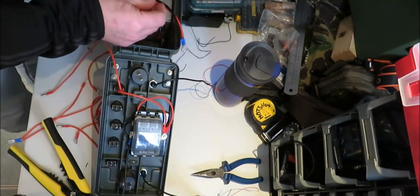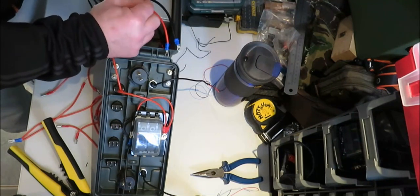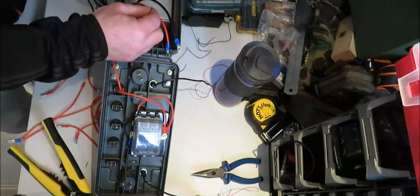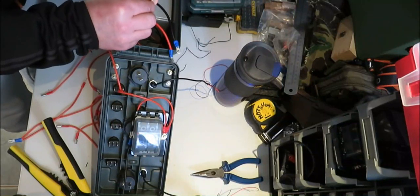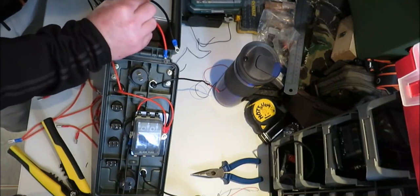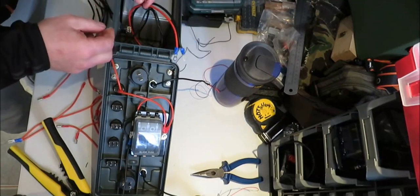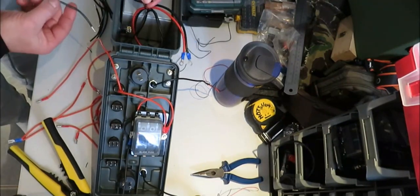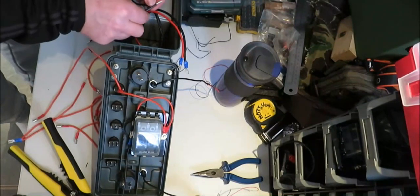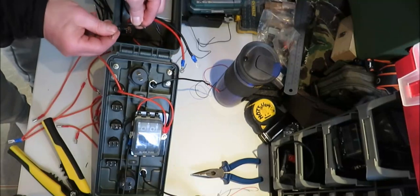That's two. Now, with these two wires, the two negative wires, you want to twist them together. They're dead thin. Then you want to get your negative for your battery and also twist it round. Twist them round that. So you've got that like that. Right? So what you want to do now is get another piece of wire, because what we're going to do here, we've got to put a terminal on these. Got to put a blade on here, twist it on there, and then that'll go into there. And then we've got to do like a daisy chain effect.